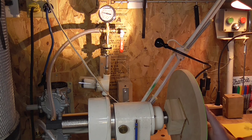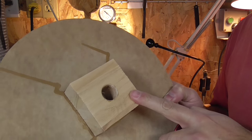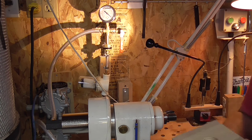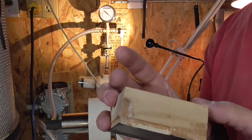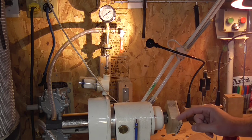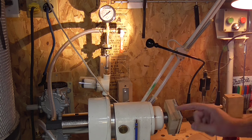With the aluminum faceplate I had about 12 inches, and 12 is not good. My first thought was that the aluminum faceplate was the problem, so I made a block — but that was not good either. So I tried a kind of block: I tap the hole and seal it with wood, but inside I place a little sheet of foam, all glued together. We will test it — the wood block with the foam and the plate is a complete gem: I have the total negative pressure, 29 inches. So it is a good solution.